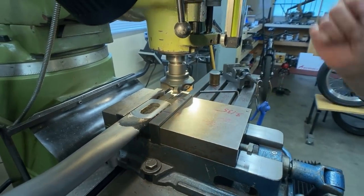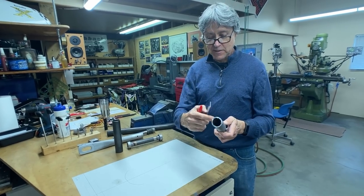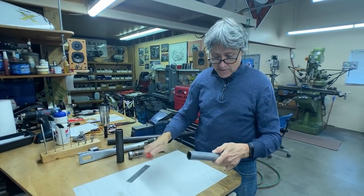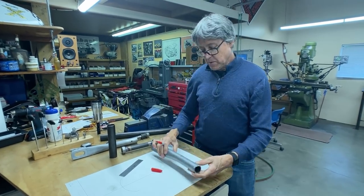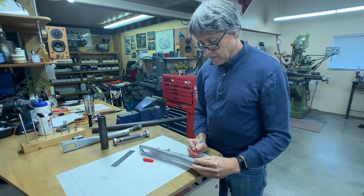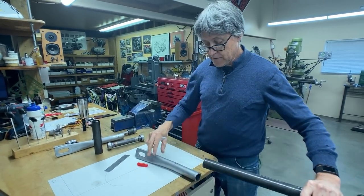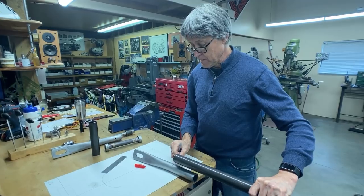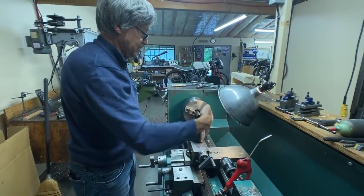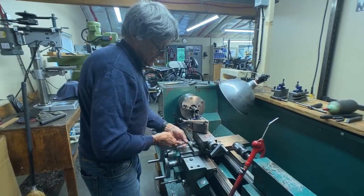We'll take this out now and I'm going to show you what comes next. I have to machine this down. One thing I want to do is see where the bend actually stops. Looking in the light, it looks to me right about there, so I'll make a mark with my felt pen. We're going to go over to the lathe. I'm going to hold this in the chuck and machine from here to here, then cut this off and the tube is going to slide over — it's going to be a nice tight fit. I'm going to change the compound and put a slight angle on it so we can cut a little taper on the very end of the tube, probably three degrees — something pretty small.